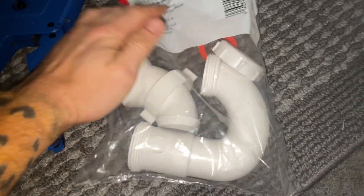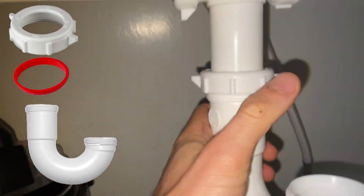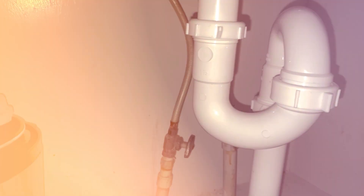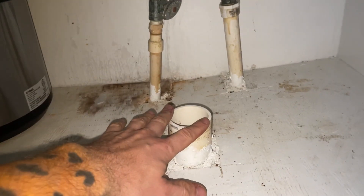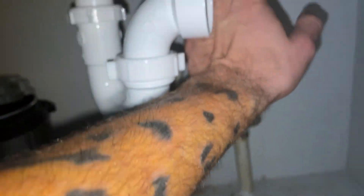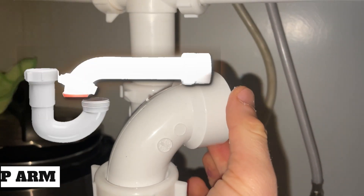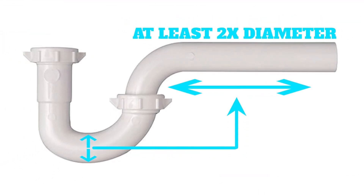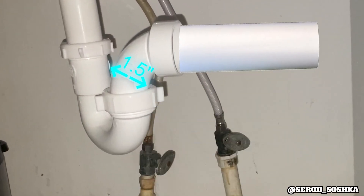Connect your P-trap from the kit first. Make sure you put the rubber washer the proper way, with the wider part at the coupling nut and the narrow part towards the pipe. Because of the S-trap design, it's pretty much two vertical plumbing lines with an S-curve, and it's not allowing the required length of trap arm, also called a waste arm extension. It should be at least two times the diameter of the pipe — so with one-and-a-half inch P-trap lines, the straight run should be at least three inches.